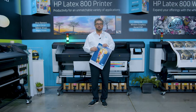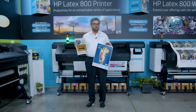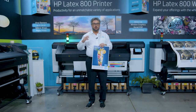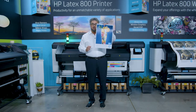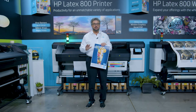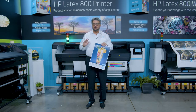However, we know there are applications where you're going to laminate. For example, I have two products here: an Ultraflex PET roll-up banner, and a 3M high-intensity prismatic film. This roll-up banner will not be laminated — we're going to print it, install it in a roll-up banner, and people are going to roll it up, and that's it. In this case, we would have Overcoat turned on, which is the default. Overcoat is turned on by default. This has a Media Locator profile I downloaded. The Overcoat is almost always set to 0.5, so you need very little amounts of it. It has its own print head, its own ink box, and it goes on top — it's the last coat. So it gives us our traditional scratch and scuff resistance, stays right on the surface, and does exactly what I need it to do.